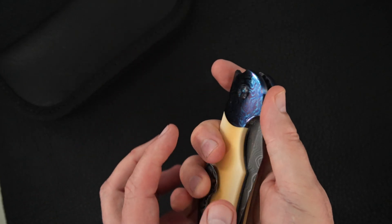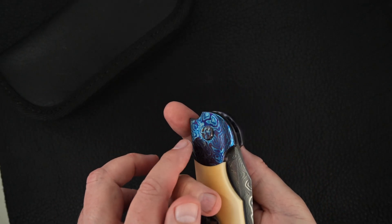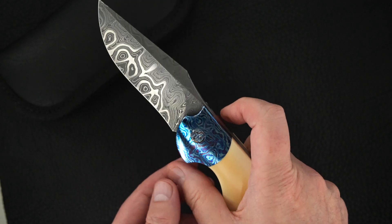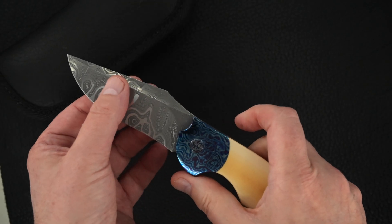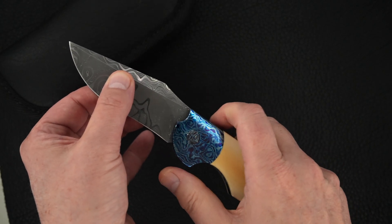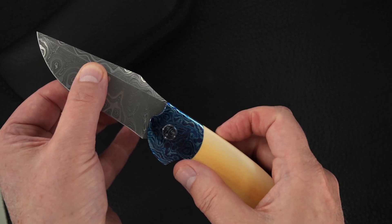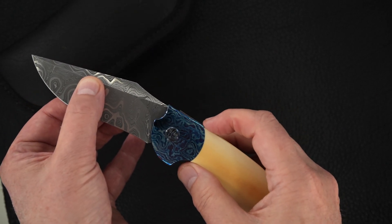The action on an NFF — if you don't know — the clip side bolster, rotated or pulled, releases the blade or flips open the blade. The front side bolster spun counterclockwise just a hair, and I'll show you what I mean by that in one second. Right now the blade's locked. I twist it just this much. You're looking right here. When the blade locks, that bolster rotates a degree or something tiny.